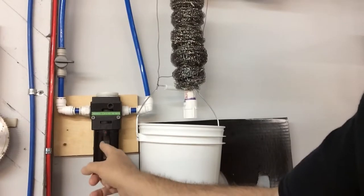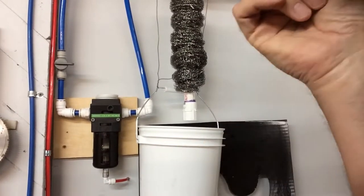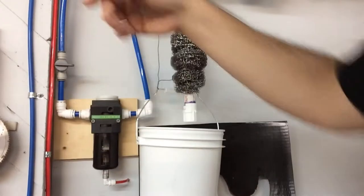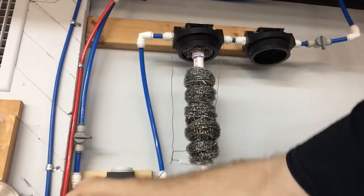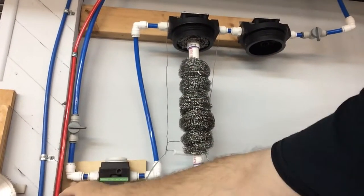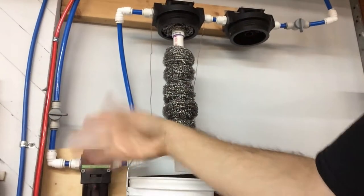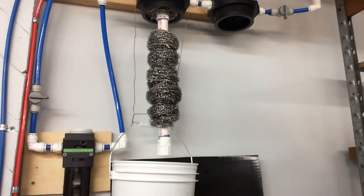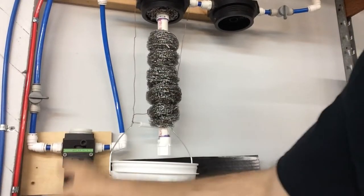It's a water trap and a filter that you can buy. This is actually a pretty decent one and it impacts the water. I purposely have the tubing coming down — I want it vertical and then going back up vertical — because obviously that's a water trap area. That's one of the secrets you'll see everybody doing. So this helps collect the water down here.